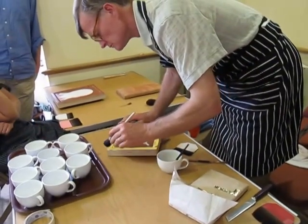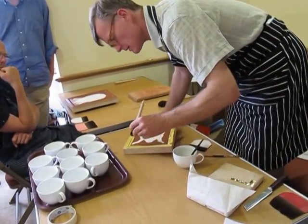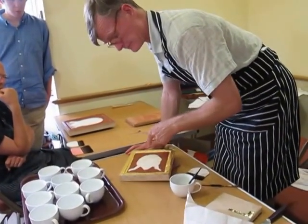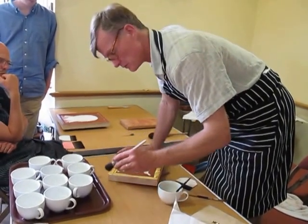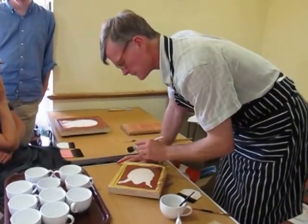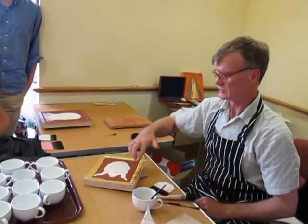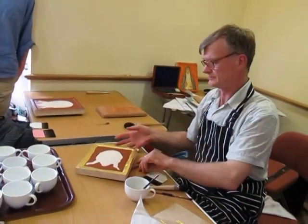I'm tamping the parts that are dry enough — if I do it too early the gold will burst. The top will dry more quickly than the bottom, so initially just tamp gently and then later you can brush with more boldness. There's a reason for starting around the raised areas rather than the face: if you gild the bottom in the recessed areas first, when you do the raised parts the water will run down on top of the gold you've already laid.